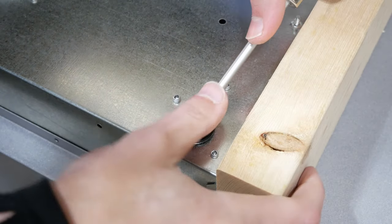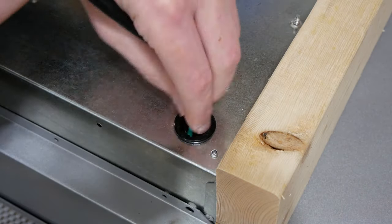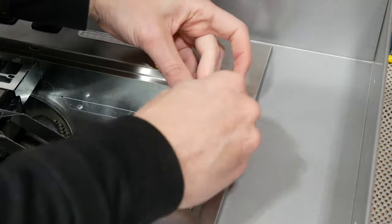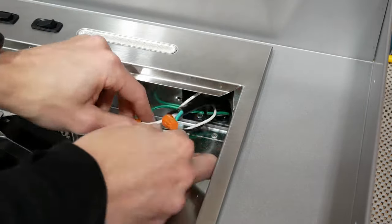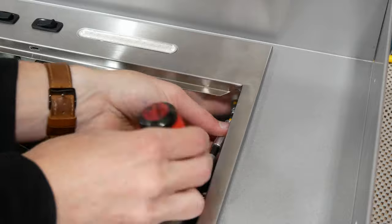On the other side of the unit I inserted a snap-in cable clamp into the knockout and pushed a power cord through the connector about an inch. Back on the front I twisted the same colored wires together with wire caps, pushed everything back inside the fan unit, and closed it off. You could hardwire this unit directly to the power coming from your wall, but it's a lot easier to install it by adding a cord and then plugging it into an outlet.